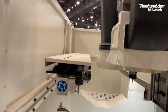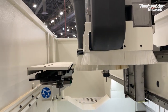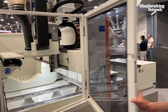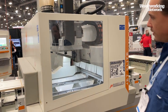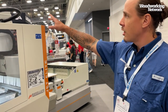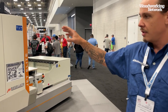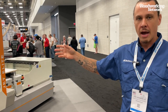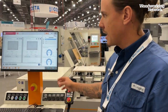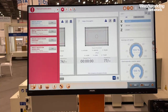The vacuum pump is integrated into the frame of the machine. We have the automatic conveyor, automatic greasing, pendulum processing, electric spindle with 12 horsepower. Integrated dust collection shutoff — so with the machine idle, we're not wasting CFM in your plant. The drill head and electric spindle are separated, so when drilling we focus dust collection on the drilling operation, and when routing we focus it on the routing operation. Our new software is easy to use, giving the operator full control with intuitive troubleshooting and very good descriptions of possible issues.